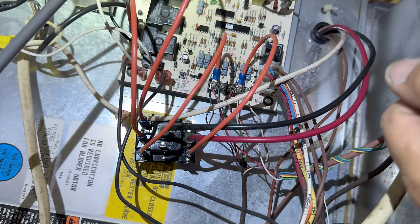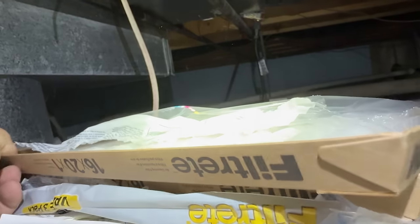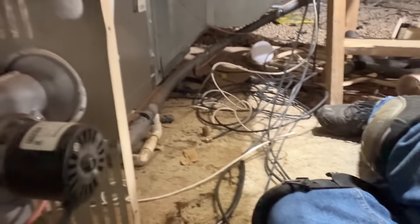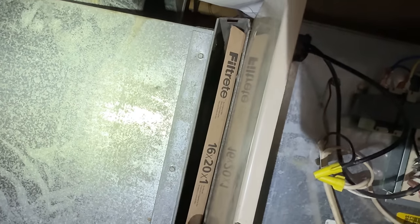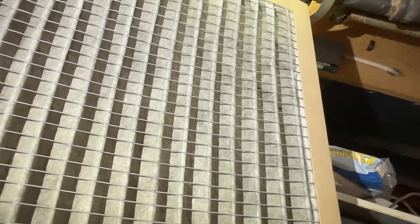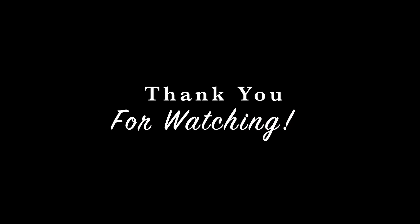If you go ahead and turn on the air conditioning, it'll change speeds. It has a filter right here, so we'll grab one of these high-end 3M filters. It looked kind of dirty — kind of like the way you said you just washed the outside unit off too. There, you hear that click? That's what it's going to sound like. That'll get you the blower on and off when it needs to. It'll still shut off like normal. You had it a little bit backwards though — you want the mesh on the side that goes towards the blower, so if the thing gets dirty, that wire holds it from getting sucked into the furnace. Theoretically it doesn't matter because it's just the same media on either side. Let's go outside and check the charge.